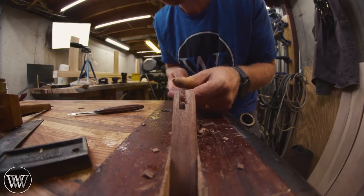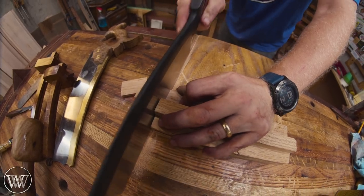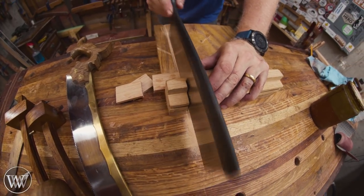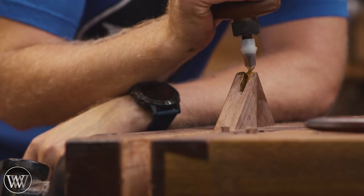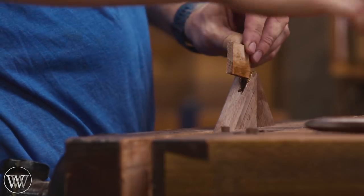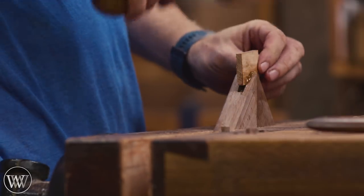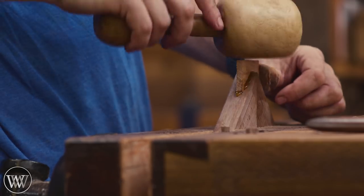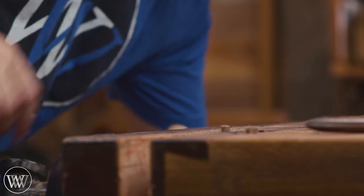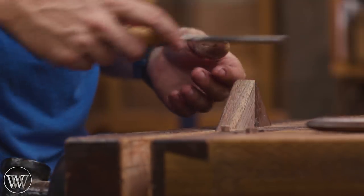For the spline I'm going to be using a couple pieces of oak, and I'm just going to cut them to a rough size — much bigger than the actual opening. I'm going to be using hide glue. Why hide glue? Because it was here, and I really like it. I cut these fairly tight and the hide glue makes them slide together easier — it's just a good glue for this joint and it's going to be far stronger than it needs to be. Once you finish one corner, flip it around and do the same thing again — only three more times.